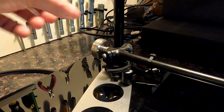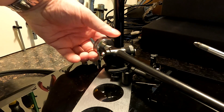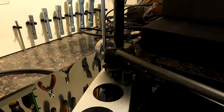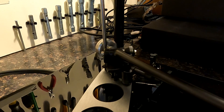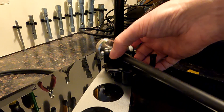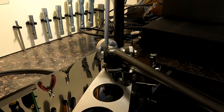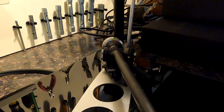It's actually quite unusual to have a fault on a Rega tonearm. The ones that do have problems are the very early R200 — the S-shaped silver arms — which unfortunately, if you get to this point and it's a fault within the tonearm or cable, you can be a bit stuck, because you can't get external leads for them anymore. It's a unique fitting underneath, and the R200 wasn't made by Rega, so they don't really have access to parts. So your option with that is to swap the arm.